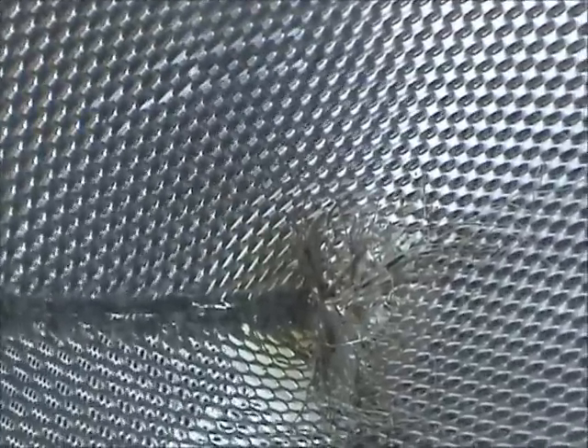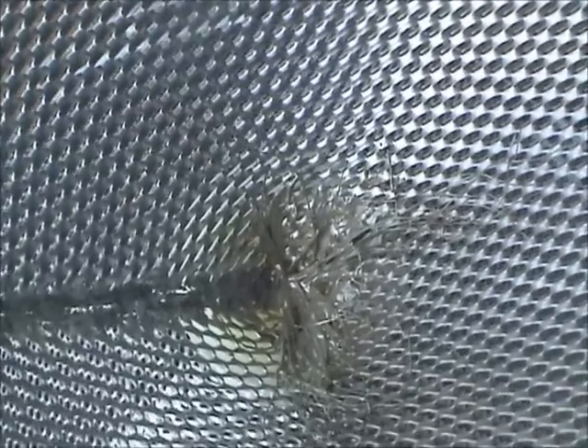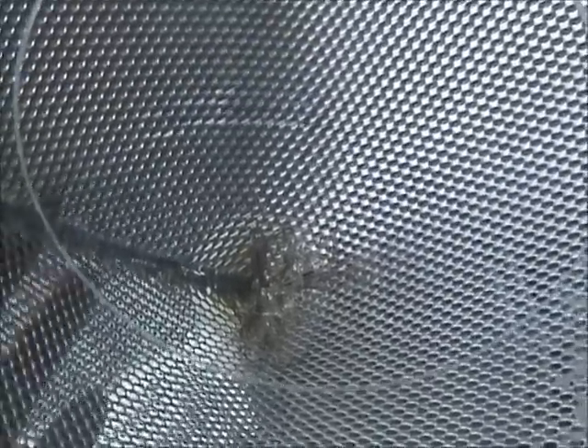At the top you can actually see that the centre conductor from the TNC connector has actually been adhered onto the aluminium with a silver epoxy resin - epoxy resin with small silver particles in it - that provides a very good electrical as well as mechanical connection.